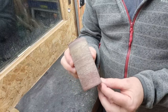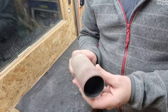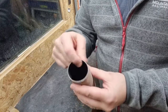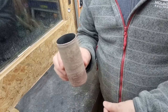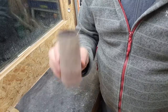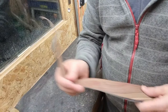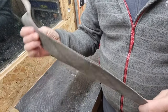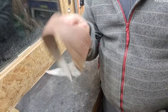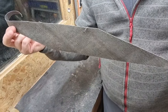The first thing we need to do is take a closer look at our old sanding sleeve, and that will show you that it's made of two pieces. One piece is the actual sandpaper and the other is a woven fabric backer. The first thing we need to do is separate them as carefully as we can — they should come apart quite easily. The important part for us is the woven backing. Here are two pieces from a 3-inch sleeve that I've already split. The sandpaper piece can be thrown away and we need to keep the woven liner.